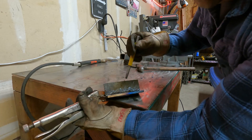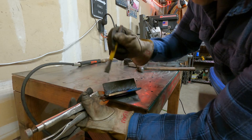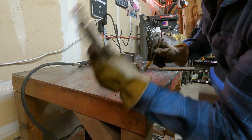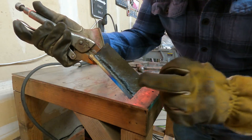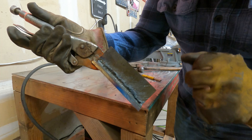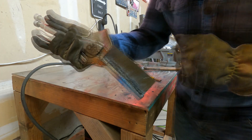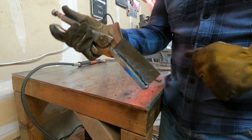For the sake of the camera, I'm going to clean things up — take some of this slag off and give you a look at what I did. So there's a nice clean scarf. I did get into the base metals a little bit, but nine times out of ten you're going to do that with a cutoff wheel anyway. That took a lot less time to remove the material and it's going to take a lot less time to grind and clean up.